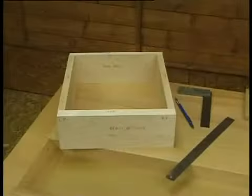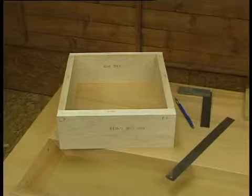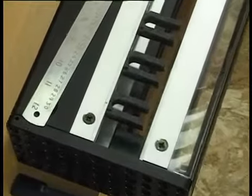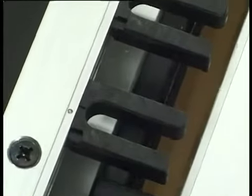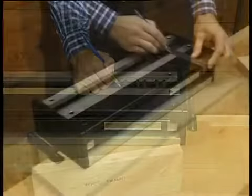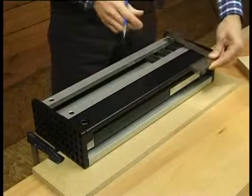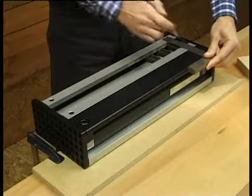Prepare the components to size as detailed in the manual, marking each part accordingly. Install the tail guides spaced as per the dimensions in the manual. Note that the first guide is installed one notch to the right of the reference mark. Then record these positions. You may find it helpful to extend the marks to the rear of the jig as an aid to lining up the router with the tail guides.